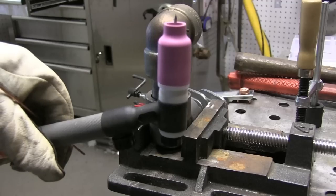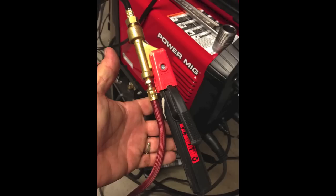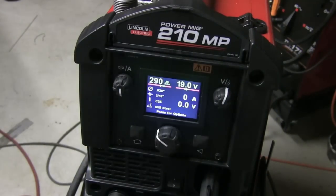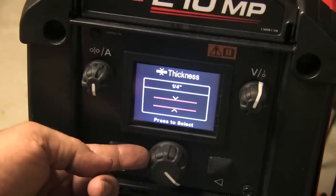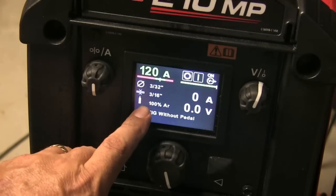I'm using an air-cooled 17 style torch with a valve on it, and I'm using a Lincoln PowerMig 210 MP — just using it almost like a scratch start, except it's lift arc. Just using this little fitting here, part number 105Z57. You can Google that; you'll find it on Amazon, eBay, and lots of other places. Now you can use a foot pedal with this machine, but if you buy it as it comes, it doesn't come with a foot pedal. You can always just use the lift arc function without a pedal, like I'm doing here today.